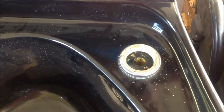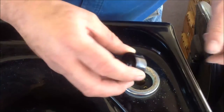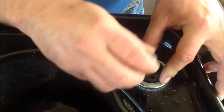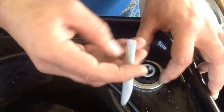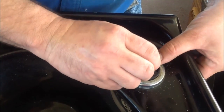Take your body and line up these square holes with the large round holes inside the faucet. Put your insert back in — it doesn't matter what direction on it. Put your stem in, in the direction that it was when you removed the other one. Put the notch to the back.